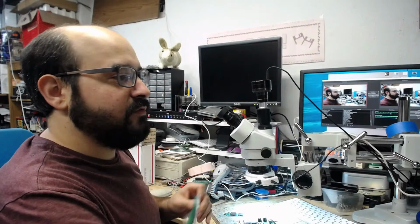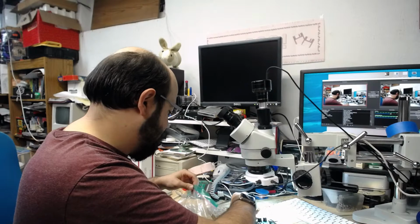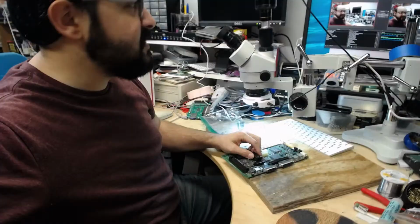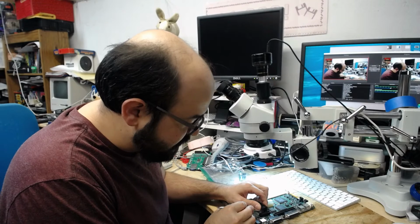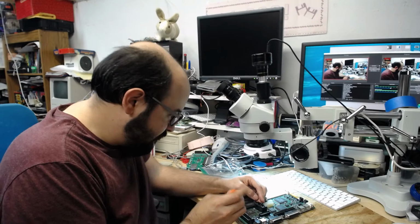Checkerboard video lines. Okay. Well, that is certainly a symptom of capacitor failure. So what I am doing is taking your little parts here. I'm sorry you guys can't see this because my camera's too high. I am just simply taking out the memory, which thankfully this machine has metal clips for the sockets. And I am taking off the battery cover because I do not want to lose these little accessories as I'm working on the board.